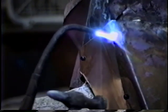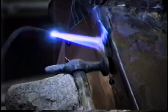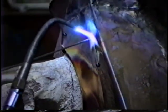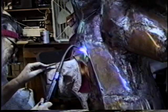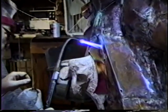And we'll tack it and we'll use a little planishing hammer and go along and just anneal this edge here enough so it'll lay down when you tap it. The copper's a little springy. Now what'll happen often is that the copper will expand when it gets hot. You have it laid down, but when the torch gets to it, it'll sometimes bow because, of course, metal and everything else expands when it gets hot. That's except water. But almost everything else does. See that bowed out again.